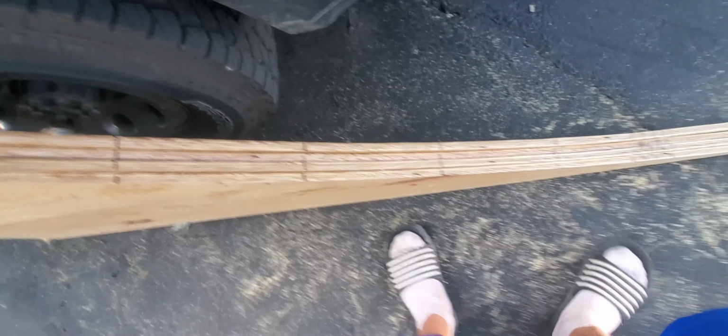All right, so I've got everything framed up. I went ahead and started throwing some sheets on here to see what we've got going. If you noticed, it's wider than an 8-foot ramp. It's an 8-foot sheet and a 10-foot ramp, so I had to stagger my sheets. The top sheet's all the way to the left, the middle sheet is to the right, and my bottom sheet will go back to the left. You stagger your sheets. You don't want your seams on seams, because that makes it weak. So anyway, screw some of these boards on here and get this thing decked, and we're about done.